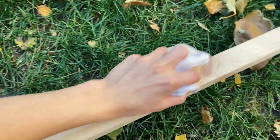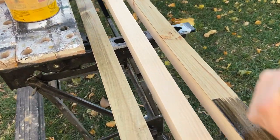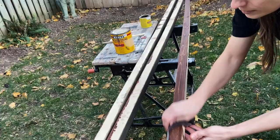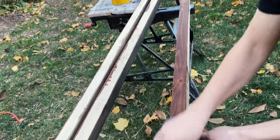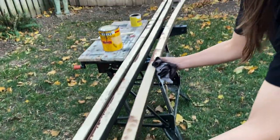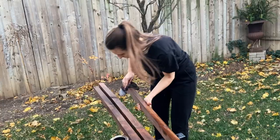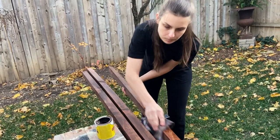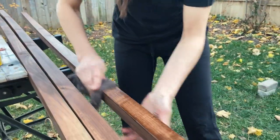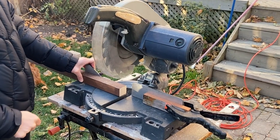After you wipe it down with a wet cloth you can go over it again with a sticky cloth if you have one. Once the wet is dry it is time to stain — pretty simple: shake the can, open it up, liberally apply, then wipe it off. You'll want to do all the sides and do multiple coats. I found two coats was good enough to get the color I wanted. You might notice the stain color changed halfway through — I had some ebony stain already at home and tried to use that but hated it, so I went back to Home Depot and picked up the chestnut color.